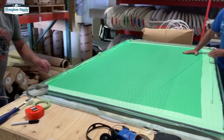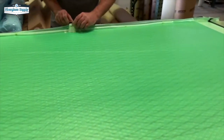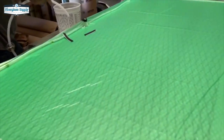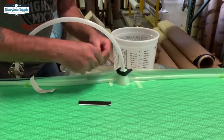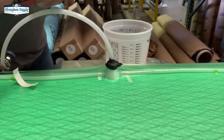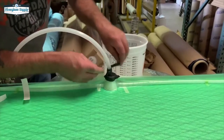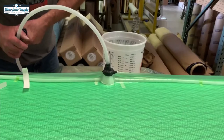We're trying to maximize the area on this plate, so there were some fibers in the way and Tim is trimming those. We'll want to watch during our test to make sure we don't have any leaks in that area — that's going to be our resin inlet. We've already pulled some vacuum and done a first test before putting the resin feed hose in, which eliminates one more variable. Now we're installing our resin feed line into the bag, and once that's installed we'll do another quick test to verify good vacuum integrity before mixing up the resin.